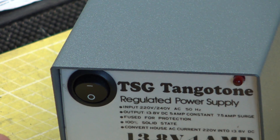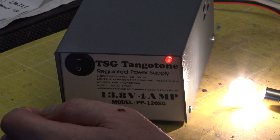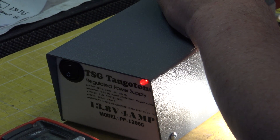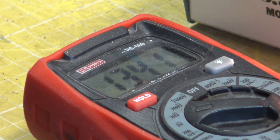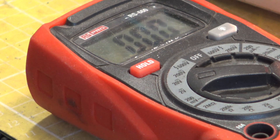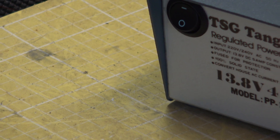I was putting the LED in. The little bit jammed like they do, so I pulled it out and it got me. Right, switch it on then. Whey! Voltmeter — 16.4. Right, unplug one end of the bulb — it was 14.04 on the off-load. So there we are — we've obviously ordered the right transformer. Made in Britain transformer! I think the next thing we need to do is put it onto the electronic load and make sure that it's doing what it's supposed to do. I'm pleased about that. That's done.